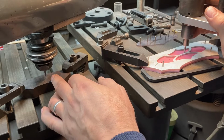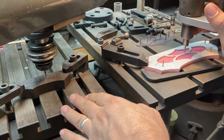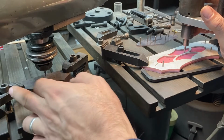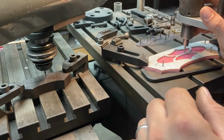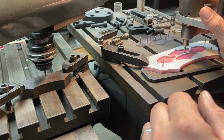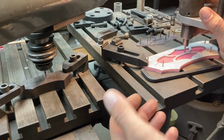And then when I'm done with that, I will clamp both of the tables in X and Y so nothing moves if I bump a lever wrong. And I'll make sure the strap clamps on everything are dogged down good so nothing can shift. You don't want anything shifting while you're cutting because that'll just scrap your piece. And with that, we'll be ready to cut.